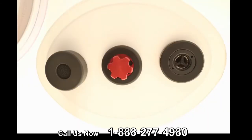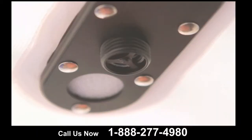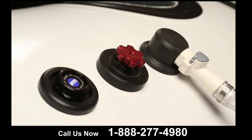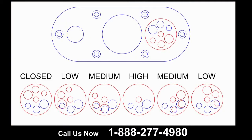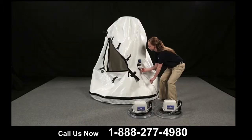Inside the chamber, the relief valve looks like this and is located on the ceiling of the chamber. One way to release the pressure from the chamber is by pressing the button in the center of this valve. Additionally, this is the dump valve for deflating the chamber and regulating the flow of air. It is featured on the interior and exterior of the chamber. The innovative design of the pressure dump valve allows you to have complete control of the rate that the pressure is released.